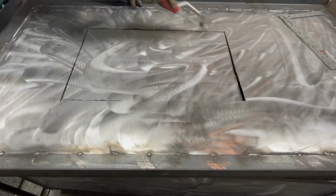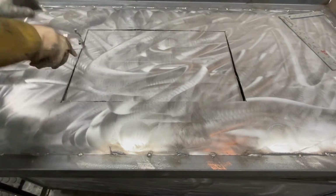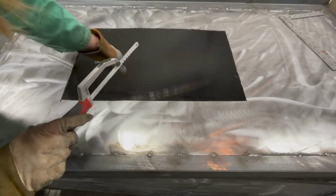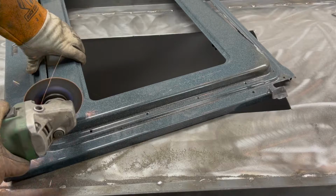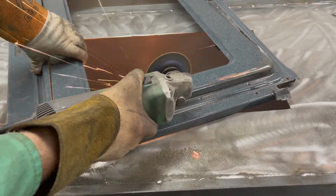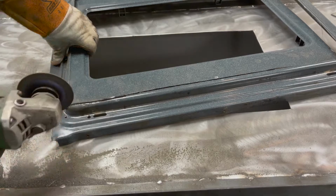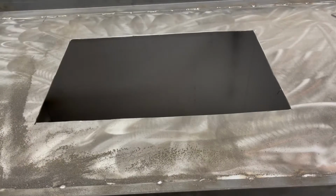It's pretty easy to underestimate the amount of damage that a cutoff wheel can cause to your hands or your eyes. So what I did is intentionally left it partially cut out and then just finished it off with this hacksaw, because that door could fall in, crimp the blade, and then cause damage by either the wheel breaking or getting it caught and then into my hands, right through a glove. It's happened before. They're very dangerous. What I'm doing now is just cutting out the excess from the pre-existing window holding hardware. It already existed, so I might as well use it.